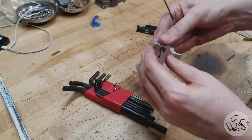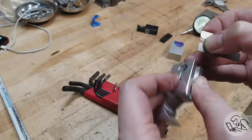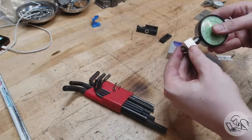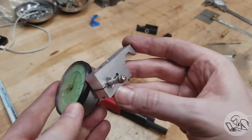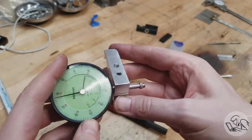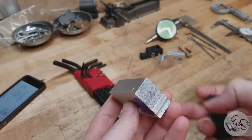These features are very tight so deburring was a bit of a challenge — a combination of needle files and actually a razor blade was helpful for getting into all the little cracks and nooks. A quick test fit on the indicator to make sure the clamp is actually going to function: I snug up the bolt and yeah, the indicator is nice and secure, and I can still turn the dial. Everything looks good.